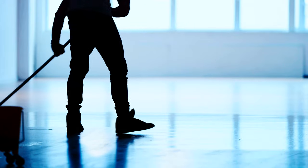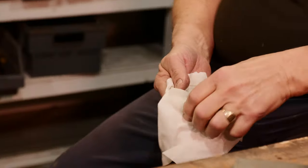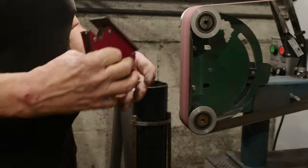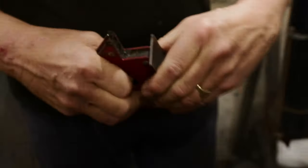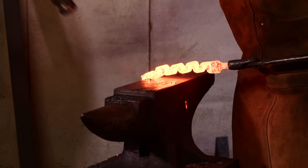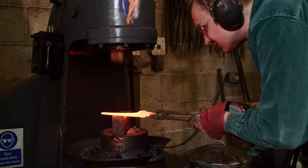The other thing is that the crystals want to grow into another crystal, so you need two clean surfaces. What do I mean by clean? A surface that is bare metal, free of oxide, free of oil and dirt. Your biggest detractor is oxide, and oxides depend on what your metal is. Mild steel is easy to forge weld because it just makes iron oxide, and iron oxide will dissolve back into iron metal at high temperatures and under pressure. So if you get any oxide on the surface, it doesn't really get in the way.